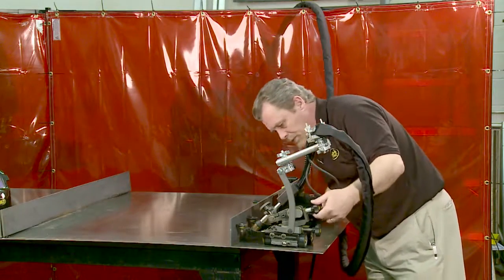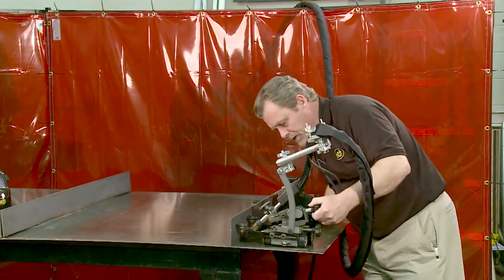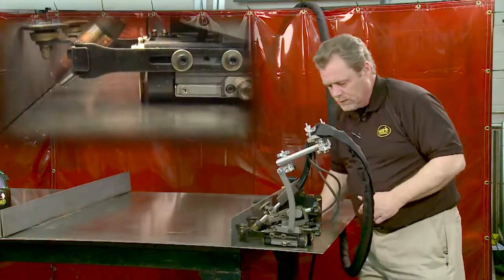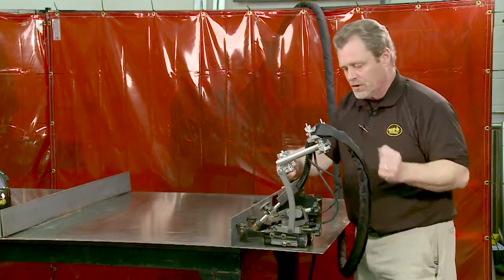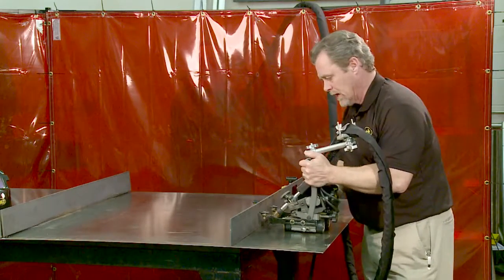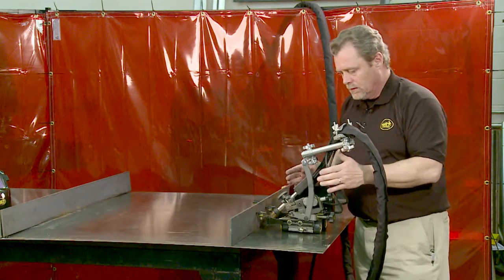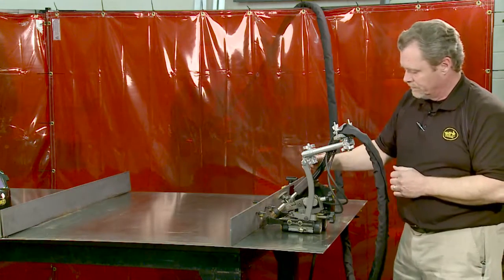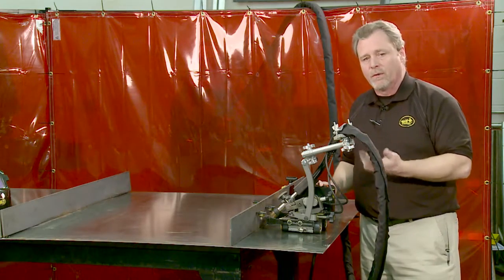We'll take a quick look at our gun position. We need to bring the gun angle up a little bit to get a good 45 degrees right into the corner, and maybe bring it a little bit closer. Now we're about ready to start welding. Position the machine at the beginning of the weld — simply slide it into position. Make sure your follower wheels are against the vertical wall. The machine is slightly canted towards the wall so that it's constantly driving against the vertical wall. We'll double-check our parameters on our weld sequence and begin welding.